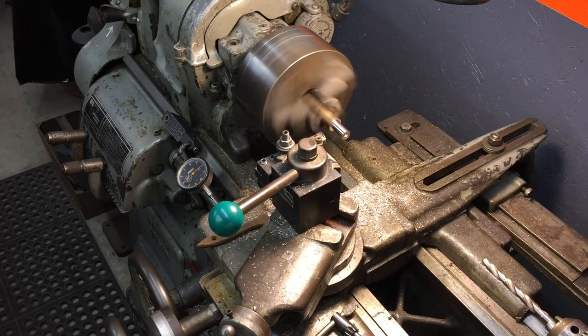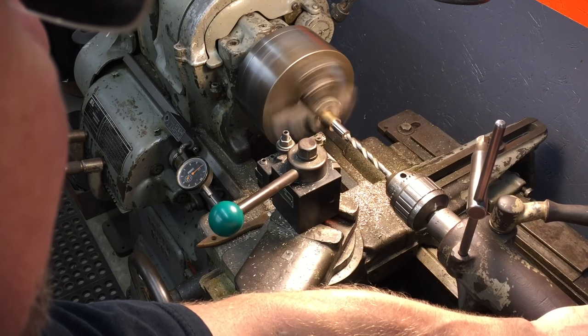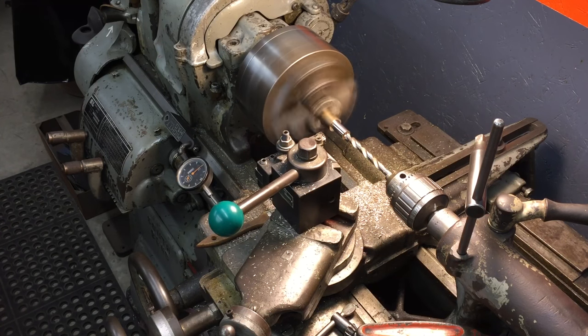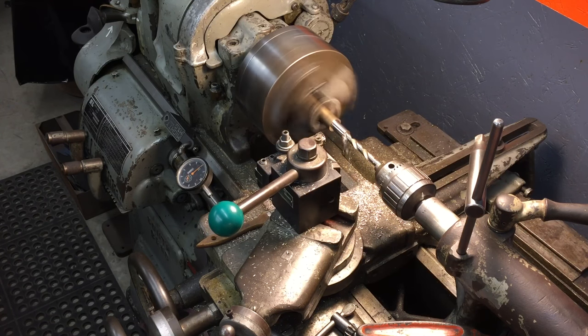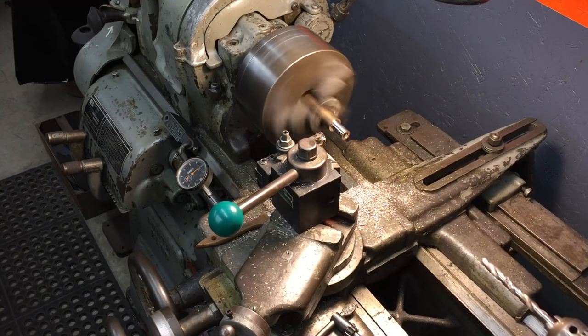I will bring this up to one inch — there are graduations on here. I am going to drill a little over an inch into it. Bring it up to where it touches, pack it off so it does not squeal, and we crank her in one inch and a hundred thousandths, because we are going to part this off and leave a shoulder on it. This is the quiet part of machining the bronze. Little gold flakes just roll out of the flutes of the drill. We are coming up on our one inch mark — that's a 16th, and that's an 8th. Back it off. That is it for that.